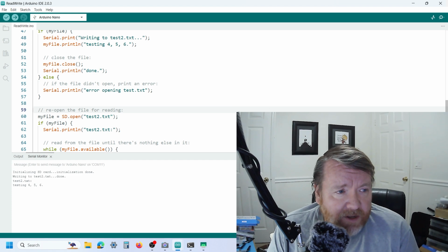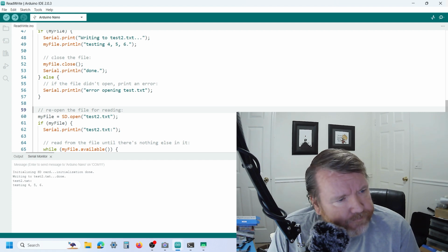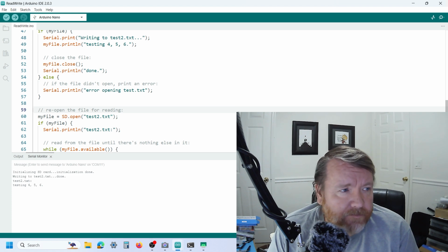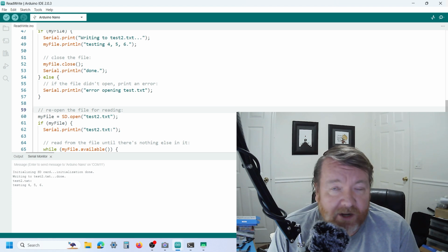The Microchip voltage regulator that I'm using has a very low quiescent current draw. The level converters are MOSFETs, so again they are very low power. And yes, the SD card reader does take 200 milliamps when it's writing, but it only does that for a split second. So again, there's no reason why you couldn't use that same approach for a battery powered application.